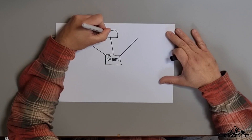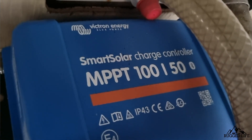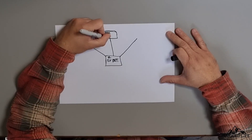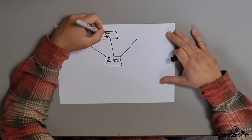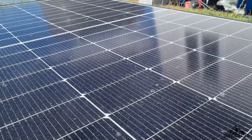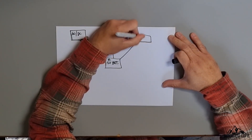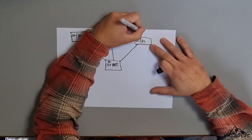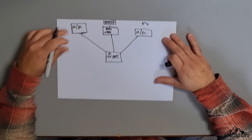The solar charge controller is either a PWM or an MPPT charge controller. In this day and age, forget about PWM — go straight to an MPPT charge controller. It's way more efficient than a PWM. So from your solar panels, you go into your solar charge controller, into your battery. The third option is called a DC to DC charge controller, because it draws power from your vehicle's alternator — DC into DC — into your battery. Hence it's called a DC to DC charge controller.